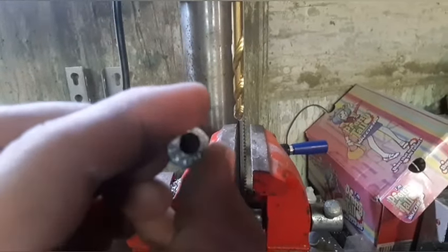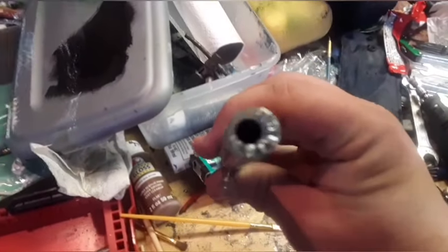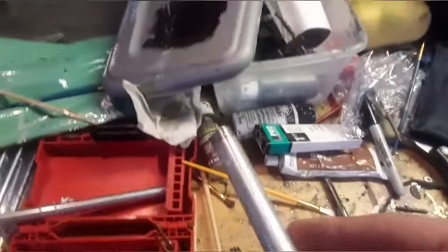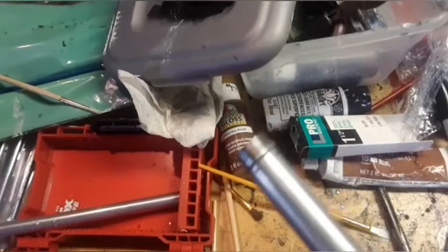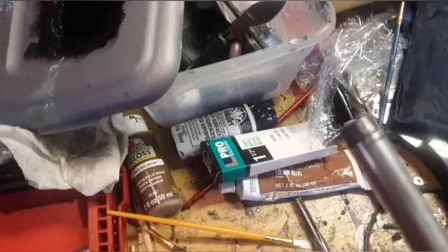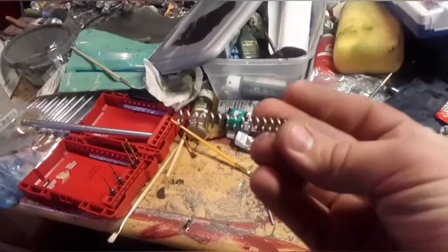You want to have as much metal on the outside and inside as possible. In that first video I asked if any of you wanted to see how I did it — that one was actually working off of caps, like for a cap gun. This one will actually be working off of a 12-gauge primer, so this is going to have a lot more power behind it. This bolt isn't very long, and the bolt is basically the barrel, so it's not going to be very accurate — just a close range shot. I would really recommend not using this in any airsoft war or anything like that, because primers can actually be deadly at close range. I also bought these springs, 0.8 by 50 millimeters, and this is what I'm going to be using for the spring for the gun.